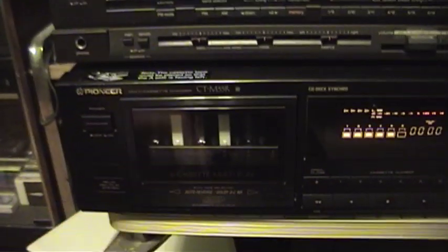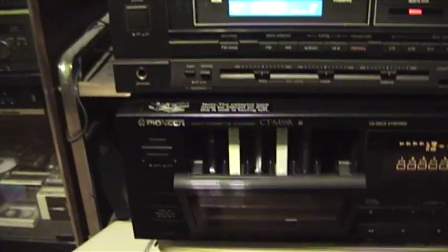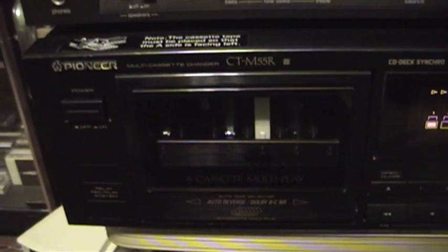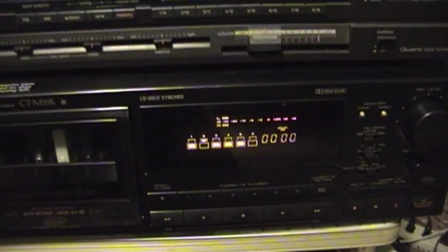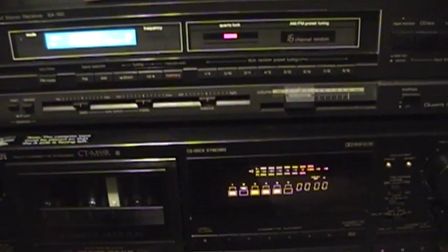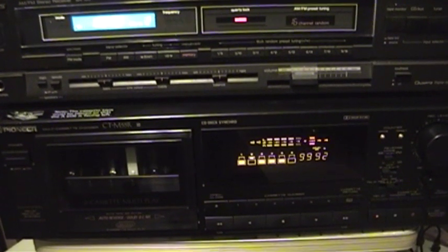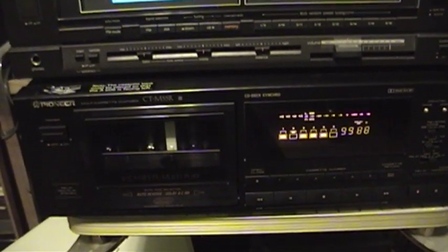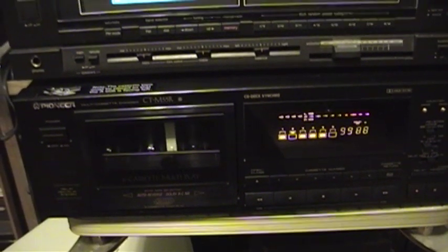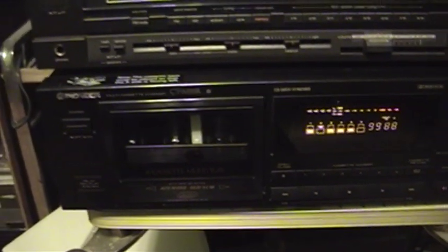Let's go ahead and play a tape. If we want to play the tape that's in position two, we go ahead and close it. It slides the tape away and then starts blinking some play symbols. So let's go ahead and try playing the tape. If you thought that sounded like the Commodores had a hard night out, they did — it's definitely running a bit slow. The speed on the mechanism needs to be adjusted. The belts and everything are good, so it's not that; the adjustments have just drifted over the years.